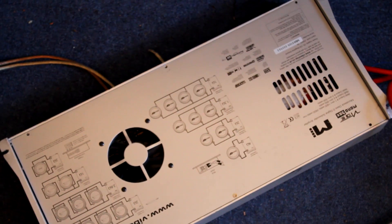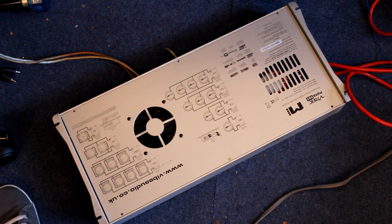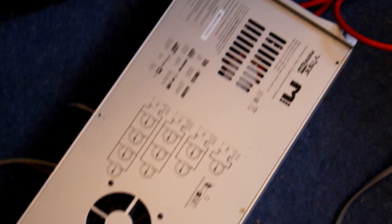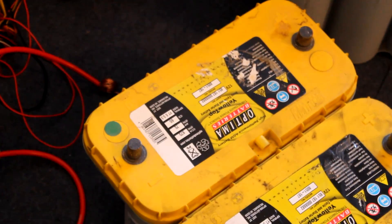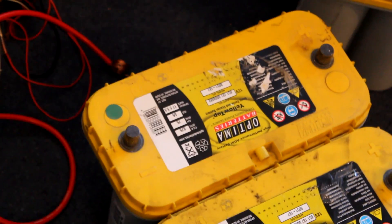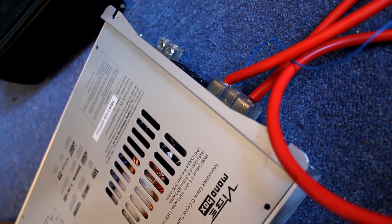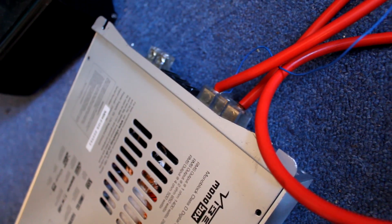This amp has been sitting in my room unconnected for about a year, maybe a year and a half. So the first time I connected it up, I used some thick wire, connected it up to the first yellow top battery — a big deep cycle battery capable of drawing a lot of current to the amplifier in one go. I connected it with a big spark and all three 30 amp fuses on the side of the amplifier blew all at once. That's showing that the capacitors, where they were down so low, it's almost like there's a short circuit for a split second, and the fuses just blew because there was too much current going to the capacitors at that given time.